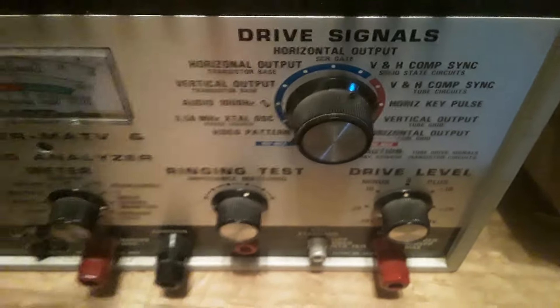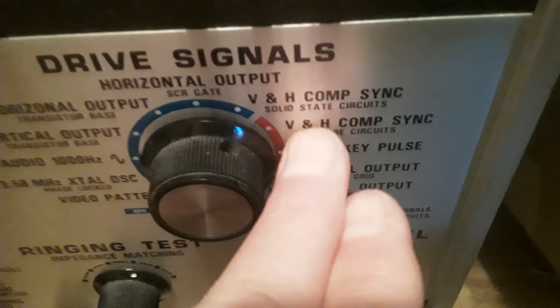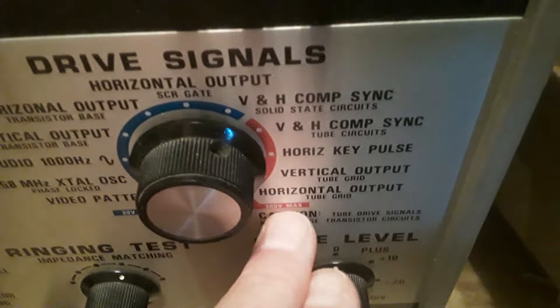Anyway, so I will get back to this baby. I was just going to throw it away, but I thought that was pretty cool to see on the TV. It's the only thing saving it, and the solid state stuff — if those two orange wires are open, I'm afraid this stuff ain't going to work. I'm assuming that's where the high voltage is used. This stuff is going to be no greater than 24 volts AC out of the transformer. I'll get back to that — I have to go get some glue sticks.